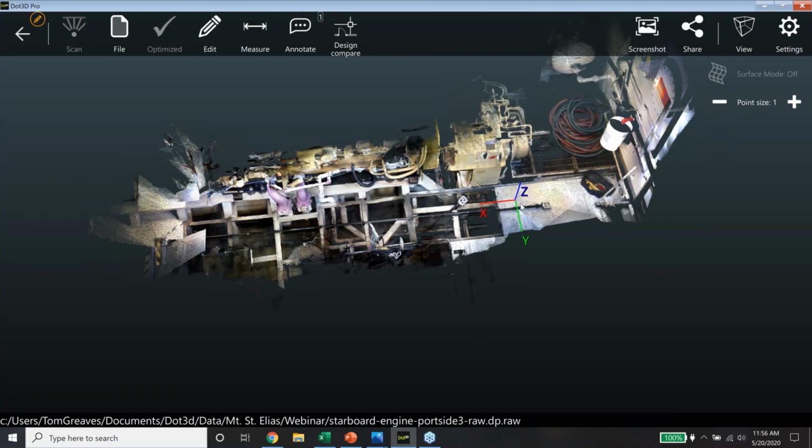These scale bars can even be acquired with a NIST traceable certificate, so they can be traced back to the standard SI meter. It's a little bit extra for that capability, but certainly can be done. So, it really depends on the application. We get very good data without the scale bars, but just the highest confidence, best data comes with the scale bars.